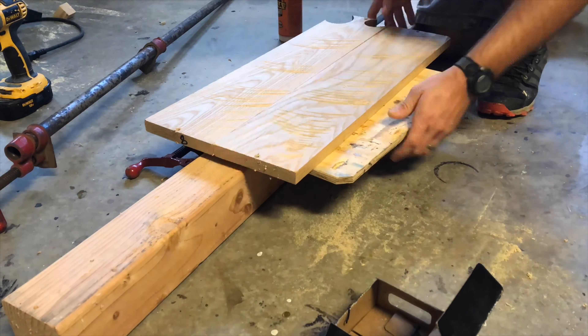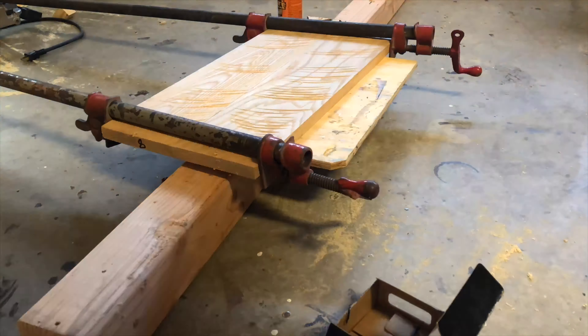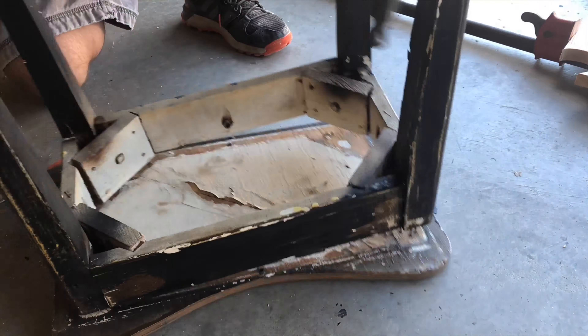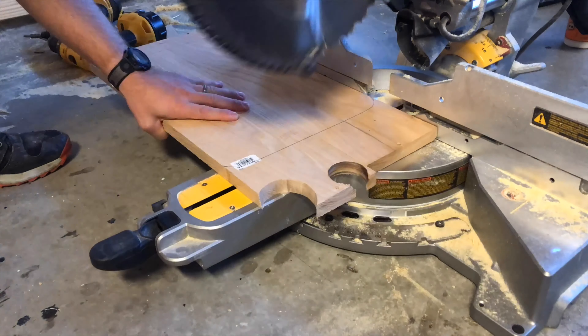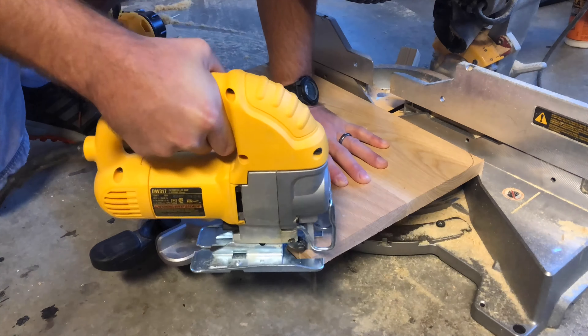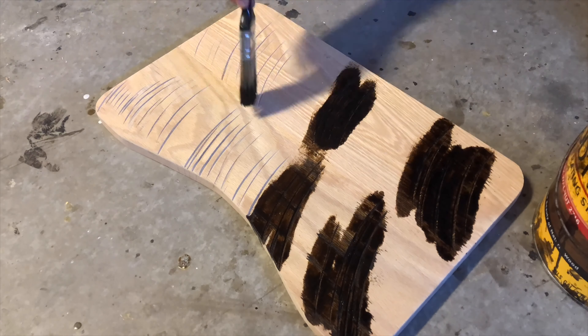Once that's complete you can go ahead and remove your boards. I'm joining mine with wood glue to make a tabletop. Here I am removing the original tabletop from the frame. I like that original design so I'm just going to trace it out on these boards. Once you've cut out your tabletop, fill the inner portions of these cuts with some dark stain.